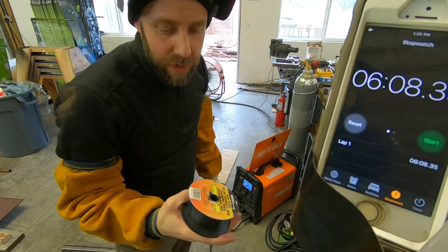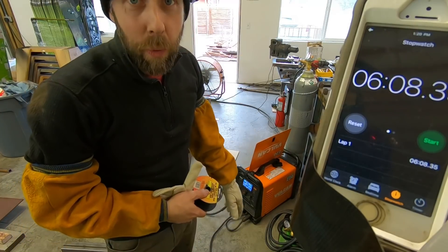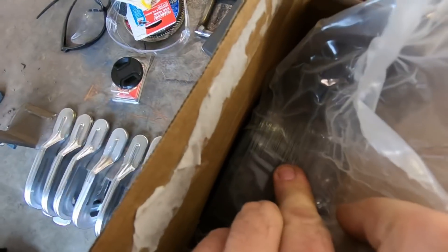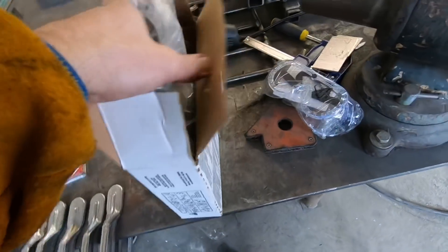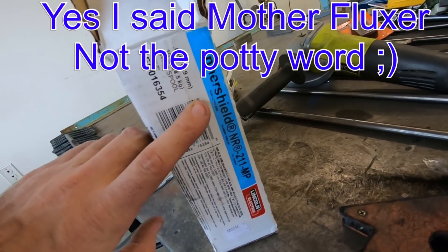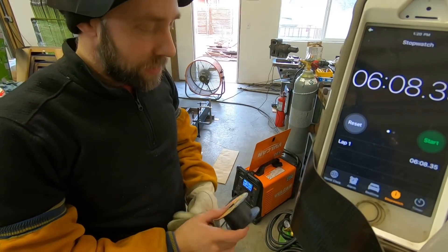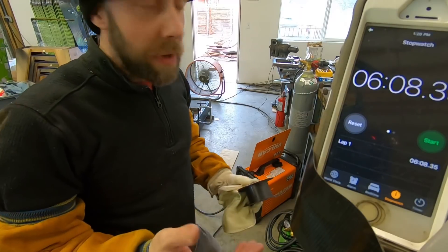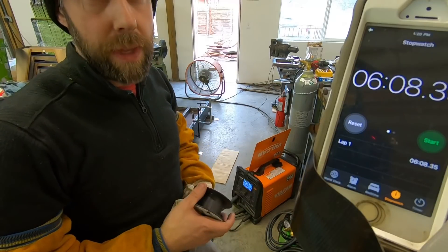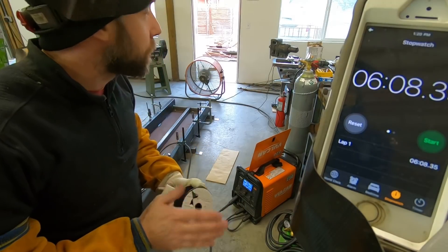Well, the Vulcan was going strong but I ran out of wire — I just had a small spool. I thought I had a big spool here but it turned out it was a flux core wire. No copper coating? It's an internal shield. Ten-pound spool, so gotta take that back. I gotta track down another two-pound spool. But anyways the Vulcan's going strong. I wish I could have ran for at least 10 minutes but we got like six-something and going strong pretty much. Solid beads of welds. I'll put another roll on here and find out.